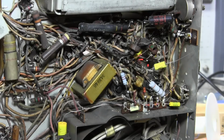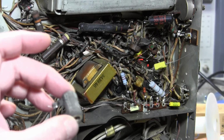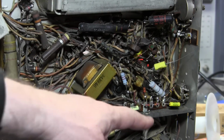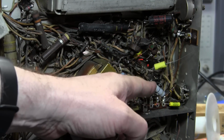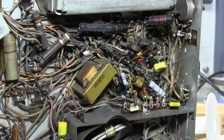It should be 400 ohms, rated for 5 watts. The wattage on this is fine, but it's 500 ohms. Now, I don't have one on hand, but I do have a 390, which is pretty darn close to 400. I think that's 5 watts, but I'm not 100% certain. So I got those in an assortment bag a long time ago. I don't remember. That's why I don't like buying generic parts so much for critical circuits, especially power users.